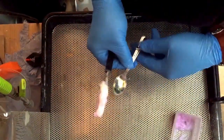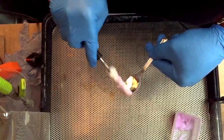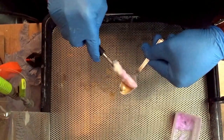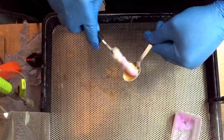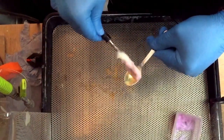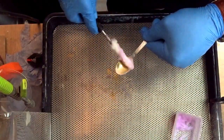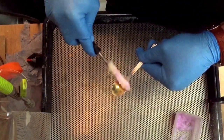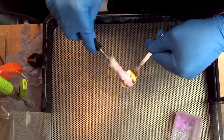Right, the negative on the item, and then you start plating. You can see straight away after seconds the color is changing. I put the voltage on four and a half in this case — I don't go higher than four and a half volts. It's a very small item so I can go down to even three or three and a half. Make sure you move the swab all the time — don't stop moving. If you stop for a few seconds the item may go dark. Move around, maybe a little bit slower than this — I rushed a little bit there. You can already see the colors.